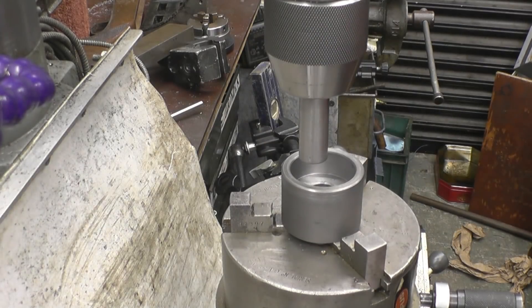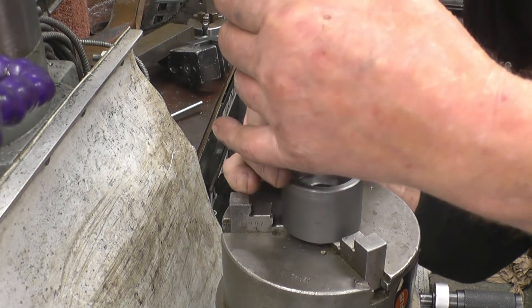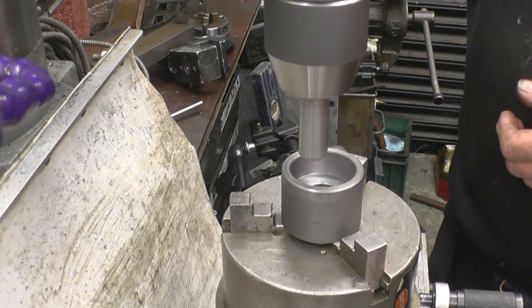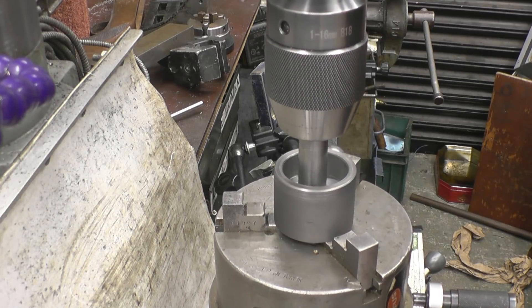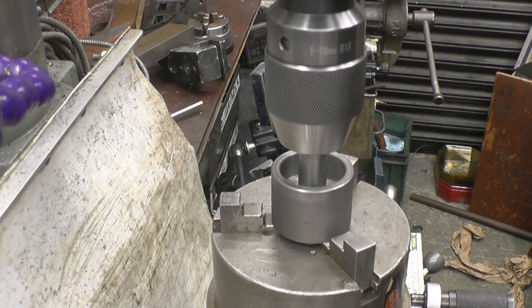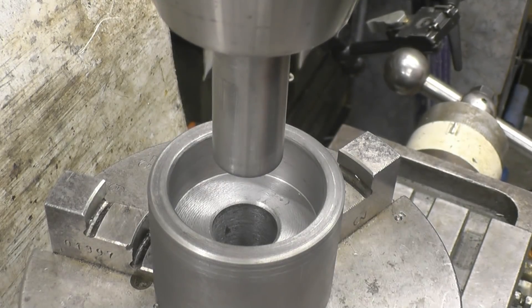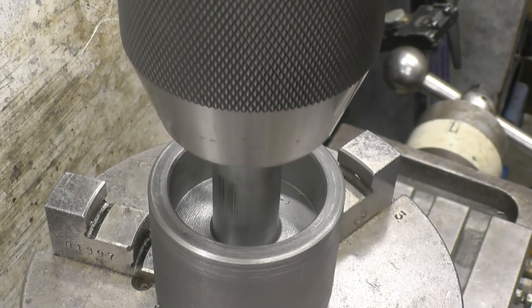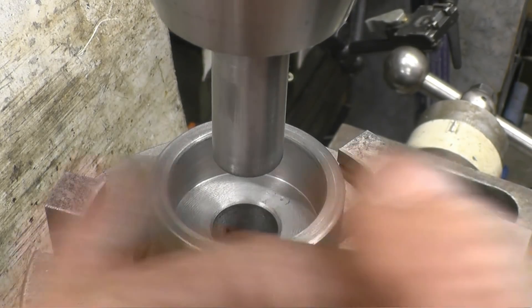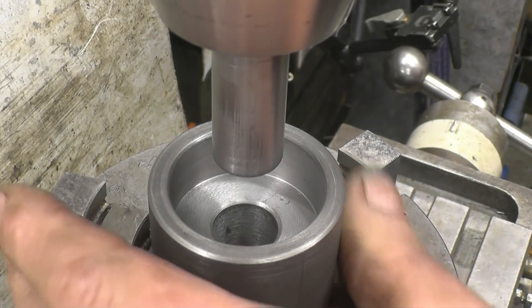Right, so that's in there. I'm going to run it up just a little bit to make sure it looks like it's running true — that's it. Right, so that's in; through tools make no difference. Now all we need to do is adjust the axis until that drops down through the hole — like that. That's absolutely perfect. So that's beautifully centred in there and I can lock the table off at that point, but actually I won't lock it just yet because I'll be moving things around. Now we know the centre of the machine is in the centre of there.